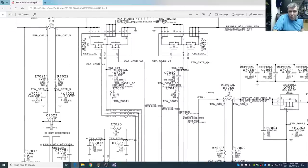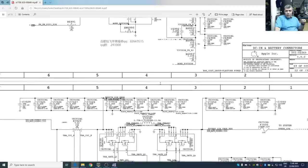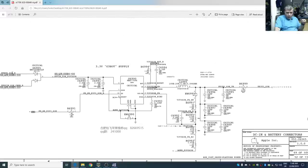How can I move this? I can't move it. That's insane. Okay, this one, we check, it's on the fuse, yeah? The bus G3H, which is 0, we don't have voltage. So obviously there will not be voltage here. So we have voltage from this one, DC in. Here we have 5 volts. On the output we have 1 volt.